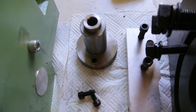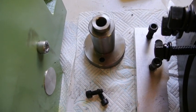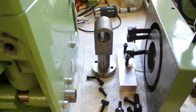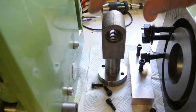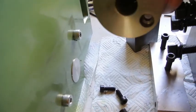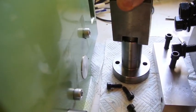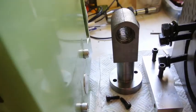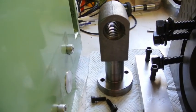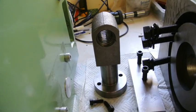This is the part that holds the worm screw on the mill. I shall reuse this piece — it's perfectly adequately made — and this is the nut for the Acme threaded rod. It's secured by a bolt through the centre of this piece, accessible from outside the mill. I did wonder about machining and reusing it, but it's cast iron and the wall thickness would be quite thin. So I'll remake it out of 7075 aluminium, which should be a nice interesting job.